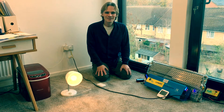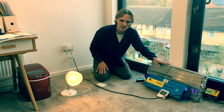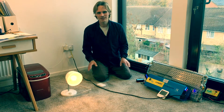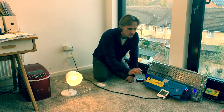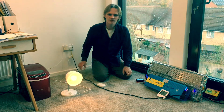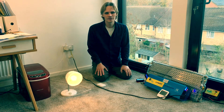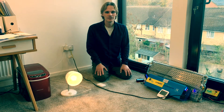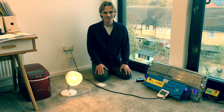So those are the four things you need to make a solar setup that powers your house: solar panels on the roof, a charge controller to prevent overcharging of the battery, and an inverter that turns the power from the battery into power for the house while also preventing over-discharging. I should also mention that this wire going into the house has a couple of 13 amp fuses on it and that'll handle about 3,000 watts — plenty for powering most of the house. Crucially, it shouldn't put too much power through these plug sockets, so it shouldn't be any hazard to the house.